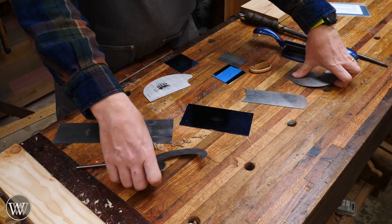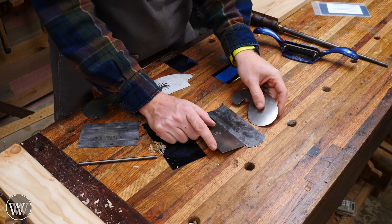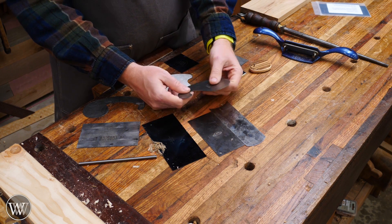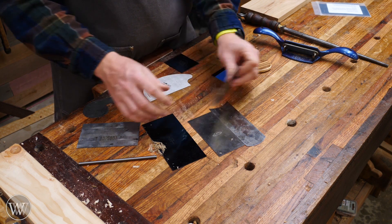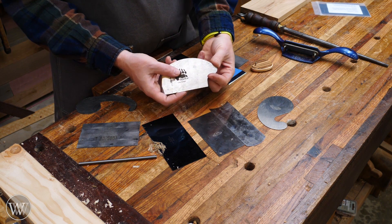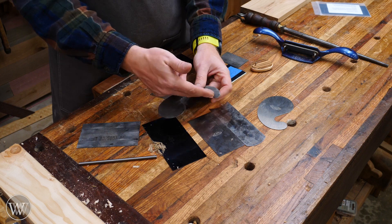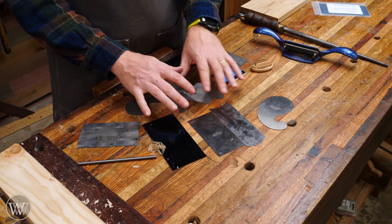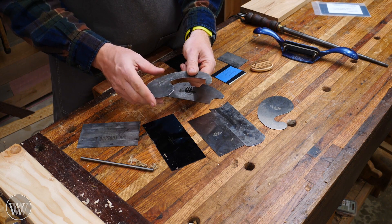For shapes and curves — these three are ones you can get on Amazon; I'll leave a link below. They come in a set, they're cheap and easy, though a little stiffer than I like. With these French curves, you can usually find a piece in the curve that fits whatever molding you're working with. If you can't find one that fits, there's also this one from Bearcat that has a chair-making curve — great for arms and large sweeping curves. You can also make your own out of an old saw plate, cut it to whatever shape fits a profile or molding. After working with card scrapers for a while, your collection continues to grow into specific ones intended for specific uses.